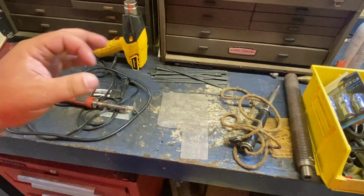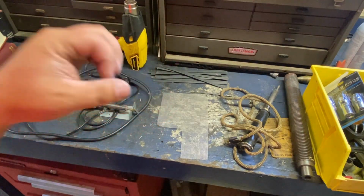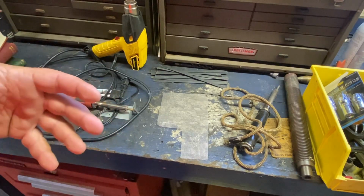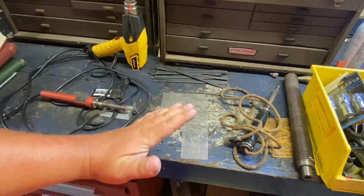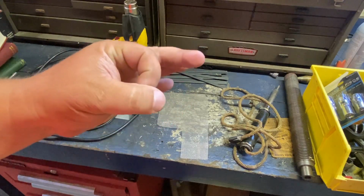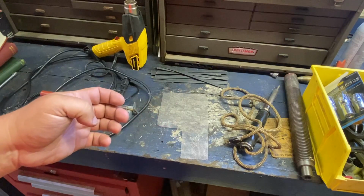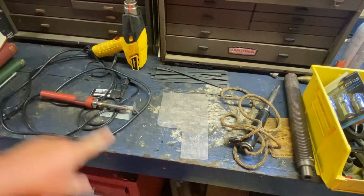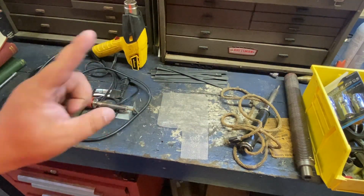I've also welded in mounting tabs, and I'll show that. Mounting tabs for gas tanks break often. On a grandstand or some commercial mowers, the gas tank will have through bolts that hold it to the frame. This will crack. You can actually plastic weld a metal washer into it and renew those connection points. So yeah, here are the tools we will be using. In the next video, we'll go through some techniques.